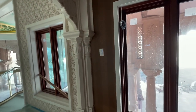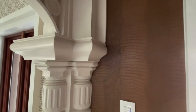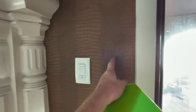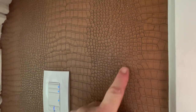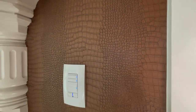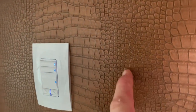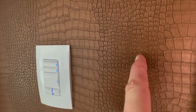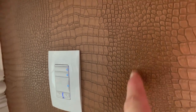And the greatest challenge was not to get the wallpaper into these crevices. That wasn't the challenge. It was keeping the wall covering constituted together despite all of these natural slices in the material. When you try to get wallpaper into this area right here, if the wall covering should fall into one of these crevices, it's weak there. If you're trying to cut over here, well, the wallpaper wants to cut where the natural crease is, and therefore, this made it quite the challenge.